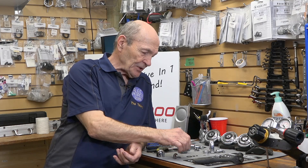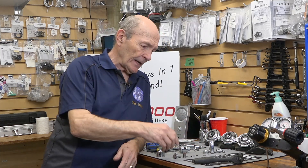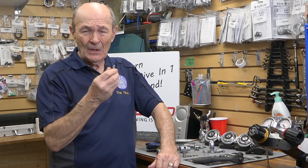The spring never wears out. The piston never wears out. So you replace the clip, the filter, and three O-rings and your regulator is done — oh, I forgot about the seat. The seat, unfortunately, is very, very important, because if your regulator is leaking or has a free flow, it's probably because that seat has gotten dirty or developed a ring on it from bouncing up and down.